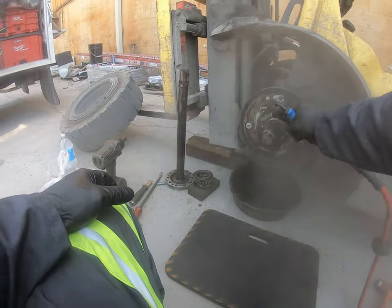I'm sure this bearing does need grease because oil does not go into this bearing. You could use a flat seal installer, but I just usually do it by hand and it works. Make sure you use brake cleaner and clean off the drum inside - make sure it is spotless clean. You don't want any dirt, grease, or anything in there near where the shoes contact the drum. Take some brake cleaner and clean this off.